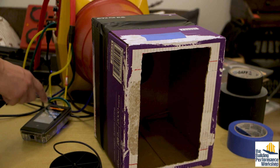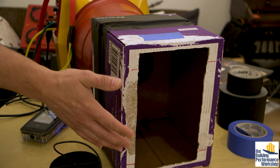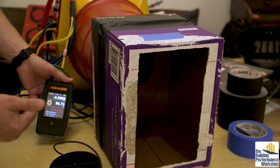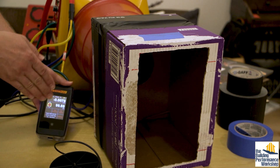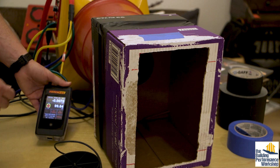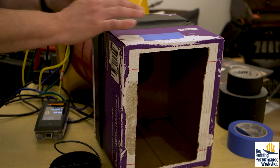We're gonna reach our target airflow at three stations — 50 CFM, 100 CFM, 150 CFM — and test the pressure inside this box with reference to outside using our static pressure probe, which you can see right here. At the middle station at 100 CFM we're at 0.0075 inches of water column. We'll record that and deduct it so we don't punish the grill for what the box itself is doing.